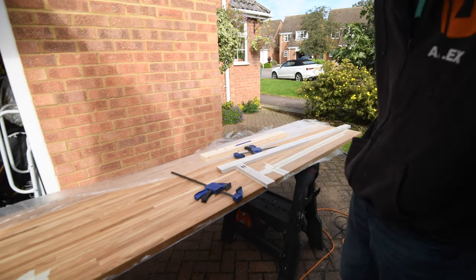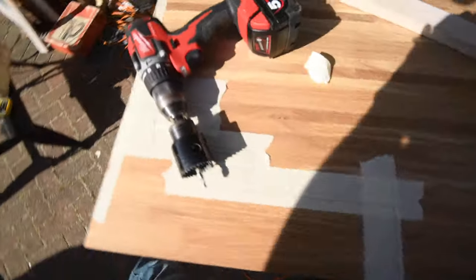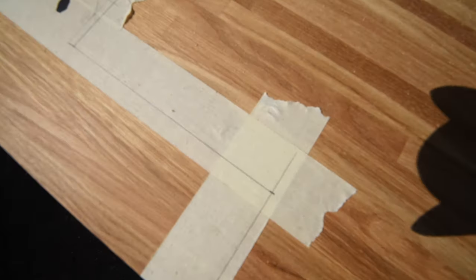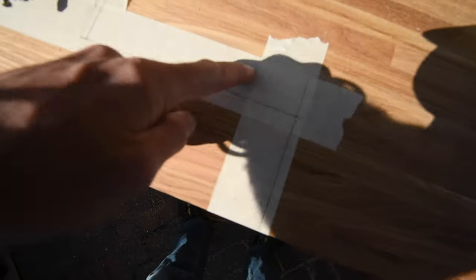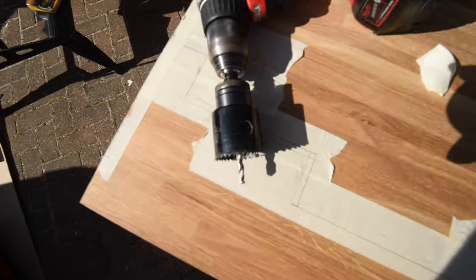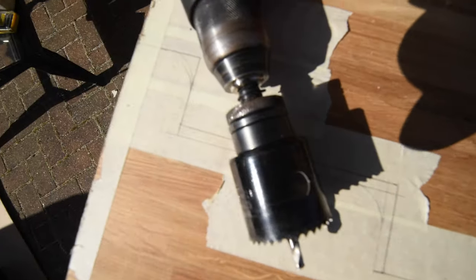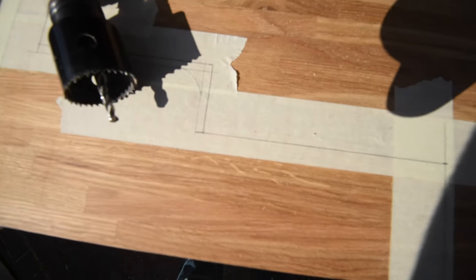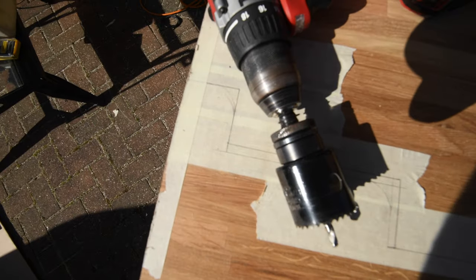I'm getting the shape of the flare, the pillar, and the door cut. I'll use the circular saw for the straight cuts and radius corners, then the jigsaw with a bit of extra room, and then use the router bit to flush trim it up to make it all nice and smooth.